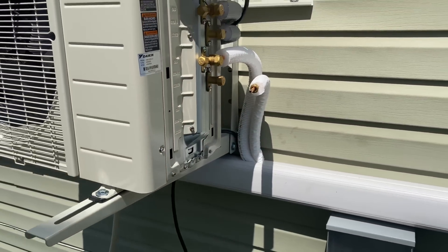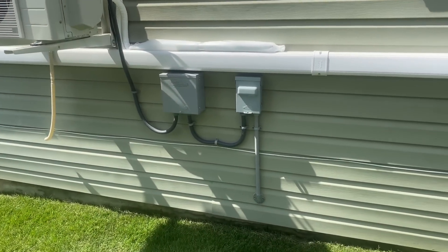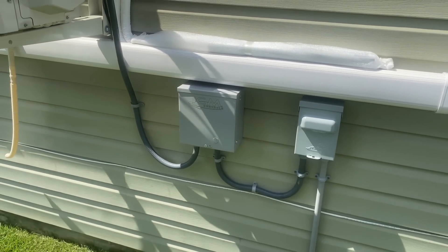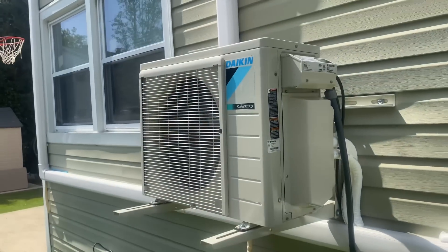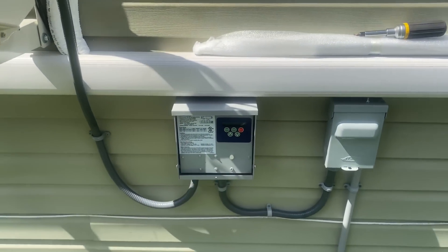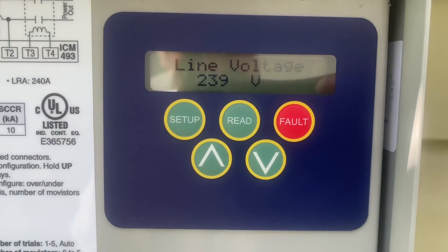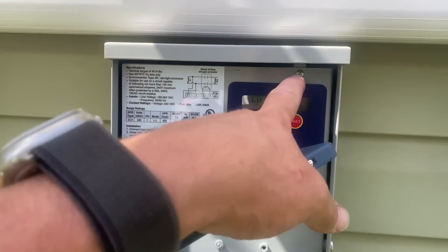We had to wait for the electrician to bring in a 20 amp, 220–240 volt circuit with a disconnect that powers the ICM 493. Let me take you inside the hood of this bad boy. This is how you really build relationships with your customers, especially with sensitive equipment like mini split systems. One surge that kills that board — the ICM pays for itself. The LED display shows incoming line voltage, which is reading 238 volts.